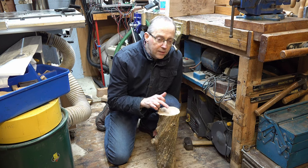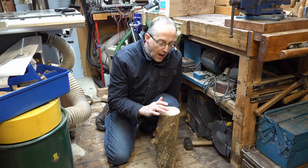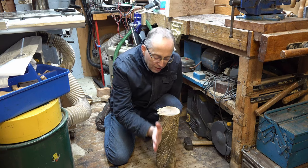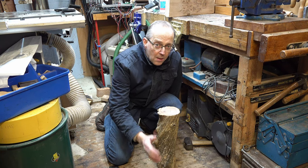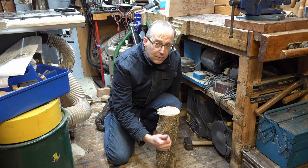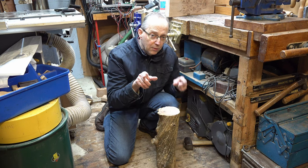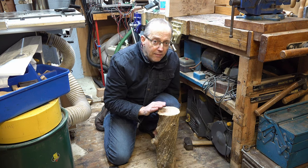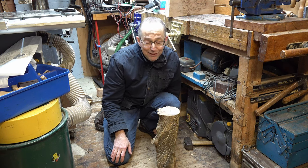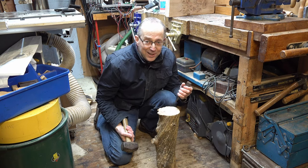The reason for doing this first split is there's a nice crack here and I want to see which direction the grain is going. If I use a bandsaw it would just go straight down through the wood, but if I use wedges and split it, it will split with the grain. I can then cut it on the bandsaw keeping the grain going from top to tail, which will make everything far stronger and it'll turn nicely — applying a bit of green woodworking to modern woodworking.